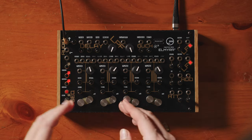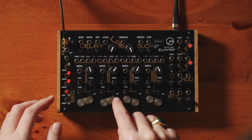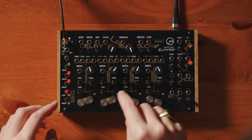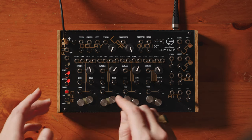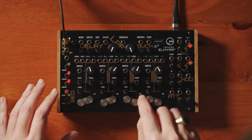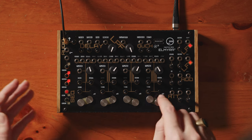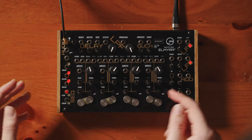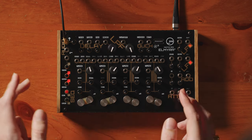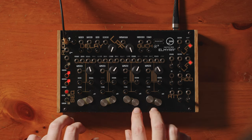And now I'm gonna check the code and input the normal hard, which you get when you turn on the device. So the code for the saturation is 1, 2, and then the amount. 1, 2, 1 is no saturation, 1, 2, 2 is soft, 1, 2, 3 the default for hard, and I don't remember the name already, but 1, 2, 4 is just extreme. So this is soft, and it's already fairly crunchy.